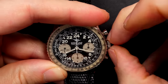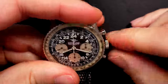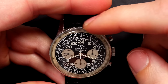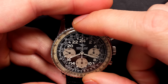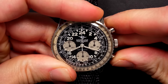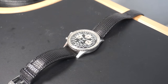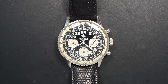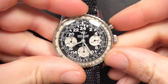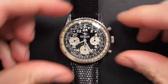The hands are moving and you can see the dial looks a bit unusual — there's something different on it, which I'll explain later. The watch is quite old, from the 60s, and it needs a good service. What we're going to do in this video is fully disassemble the watch, check everything, and make it run even better. Checking the chronograph now: the minute counter is ticking, the hour counter is also moving very slowly but it is moving. It's a 12-hour counter and everything returns to zero.